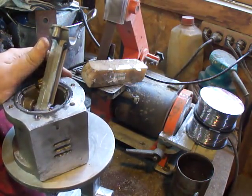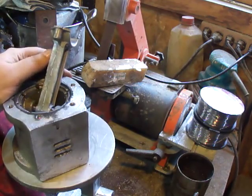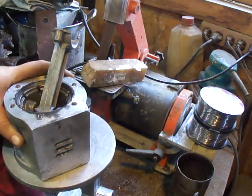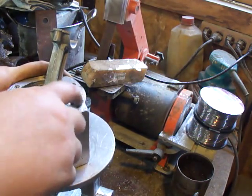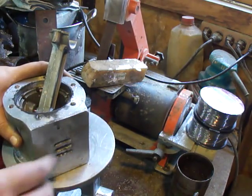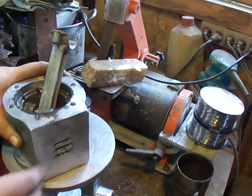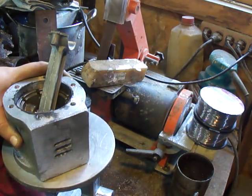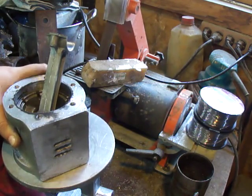When you push it down the piston really doesn't move any — it has a bunch of oil in it right now. I've got to take and face off the ends here once again because I kind of boogered them up when I was trying to get the piston liner out, and there are some scratches here which I'll just lap. I've got to drill the hole from here to the inside here, and drill the other bolt holes.